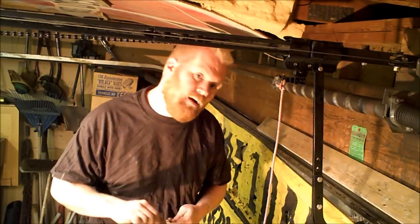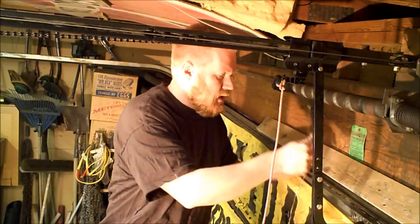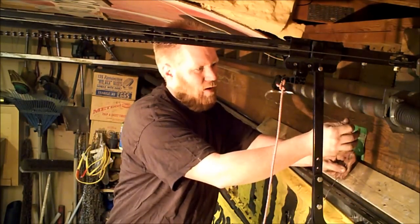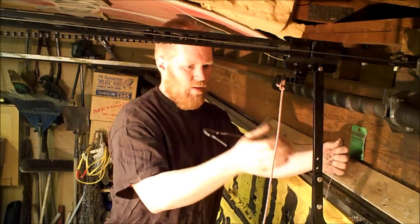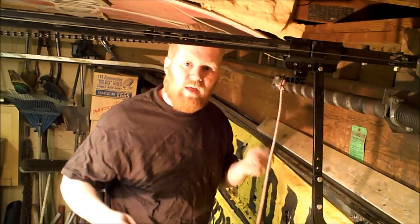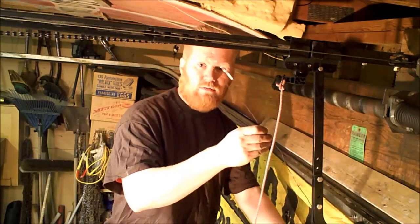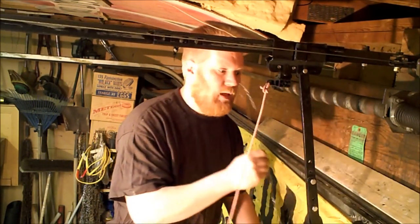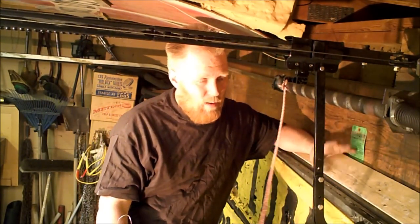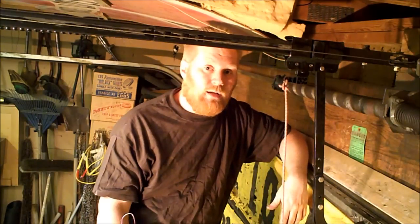There you go. I showed you the six-second video. I won't show you all the five to seven minutes that I played around trying to get this — you just can't. I tried putting a pre-bend in the hanger, but the garage door is flat, so you try to get it up and then wing it out, and you don't know how far back in you need to go. You'd need to know the exact depth, and then you'd have to wing it around — it's impossible. It's like trying to unlock a car door without being able to see what you're doing. Before, even if I wasn't able to see, the hanger was straight and you could just come up and grab the release. But now — it cost me nothing. If you had to go to Home Depot and buy a 2x4, I'd probably do a full 8-foot if you had it and just screw it on there. It costs two bucks plus some screws, and that right there saves your garage from being broken into.